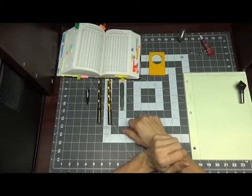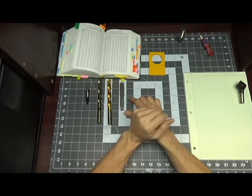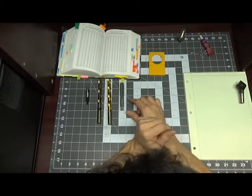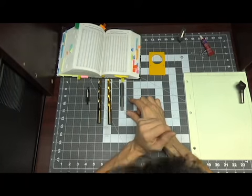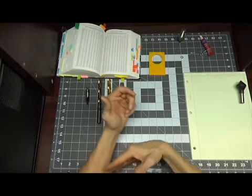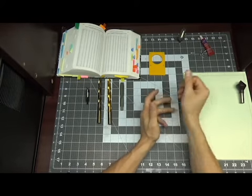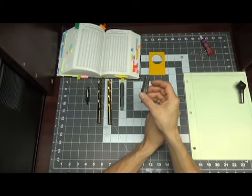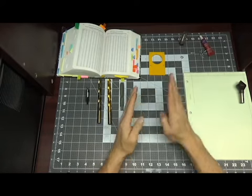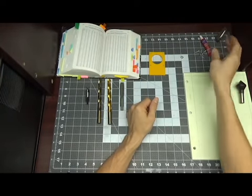Now we're in the taps. The one thing with taps that can also happen, in addition to wear, is that taps come in different size tolerances, and you can go to Machinery's Handbook and get the different flavor for, is it a 6H, is it a 4G or a 6G? All of these for taps have meaning. Okay, here's a simple thing as just getting a tap. Eventually we'll get into other taps like this specialty tap. It's called an NPT tap, which is tapered all the way throughout the thread. Okay, and that's going to be a whole different lesson there.